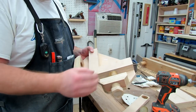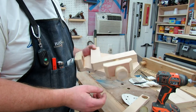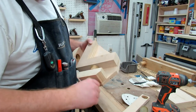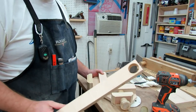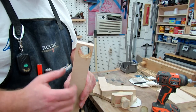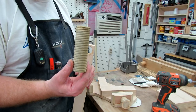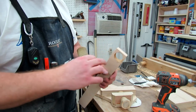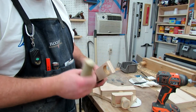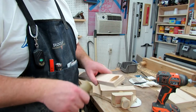Now that we've got our basic assembly finished, the next step is to take some threaded rod, cut it to four and a half inches long, and fashion some kind of handle that you can grip onto. I'm just using a piece of scrap plywood. You just want to drill a hole, thread it just like we did the other pieces, and have a four-and-a-half-inch long piece of threaded rod. I'm going to take some wood glue, put it in here, screw this in, and that will make a handle. Then I can just take a hand saw and cut this off and round the corners.